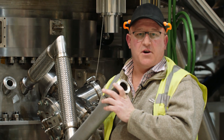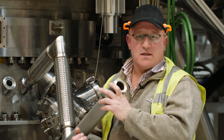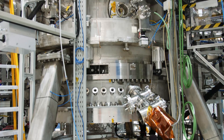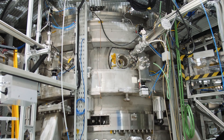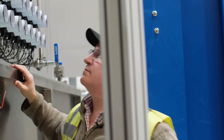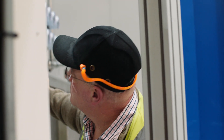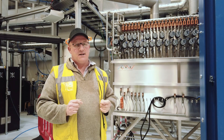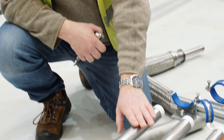We can have the liquid nitrogen system attached or detached from ST40 in half an hour. This allows us to have quick turnarounds with maintenance, upgrades or any repairs that we need to have. Because we feed the coils from the bottom, it allows the gas to escape out the top of the coil. We monitor the pressure and the temperatures coming out, and as much as the coil is heating up, we can cool down pretty much instantaneously.